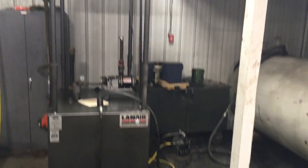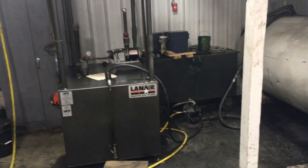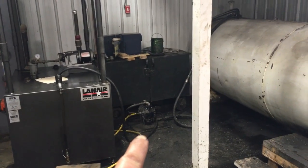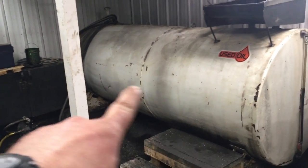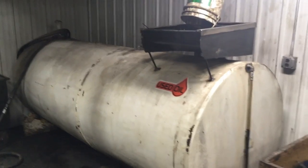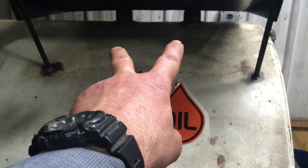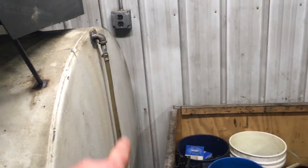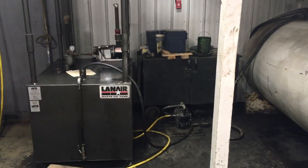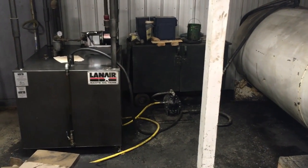This is our waste oil heater right here, and that's the oil storage tank on the bottom portion. I'm using a diaphragm pump to transfer oil from our oil storage tank — it's a thousand-gallon tank that we put our used motor oil in. We just dump our pails into this hopper and it goes into two ports on the top of the tank. We've got a sight gauge on there to tell us how much used oil is in there. After that cold spell we went through a lot of oil, so now it's time to refill the tank — it'll last a couple weeks.